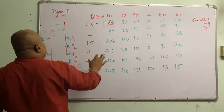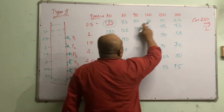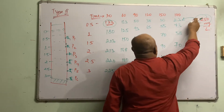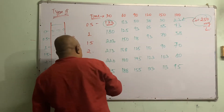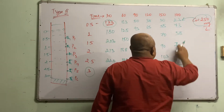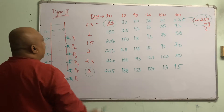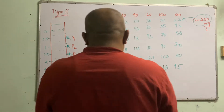With increasing time the concentration decreases. After three hours, the 250 mg/L is reduced to 23 mg/L at the top — meaning almost 227 mg/L has settled. However at the depth of 3 meters the concentration is 95 mg/L, higher than at the top, because all the settled solids accumulate at the bottom. This is the practical life analysis you have to do yourself, but in the exam we will give you the data.